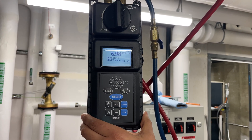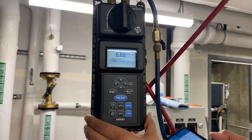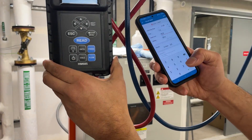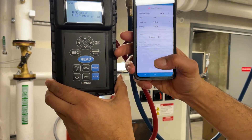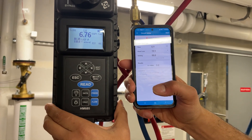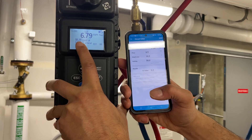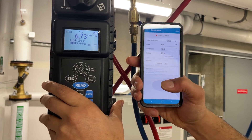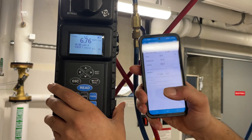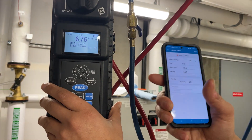If we pull up the app and update it to the pressure — 10.5 feet — enter it, 6.9 is what the app says and the meter says 6.8, because it's not exactly 10.5 feet. But you get the idea: once you know the Cv value, you can program it into the manometer and have the flow read out directly on the display so you don't have to update the app continuously.